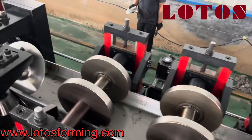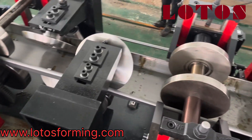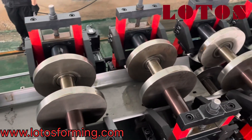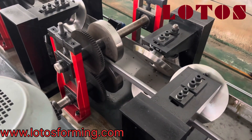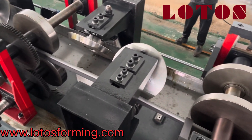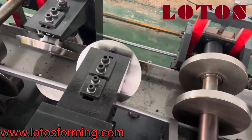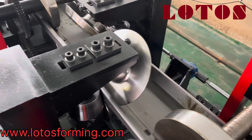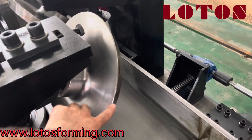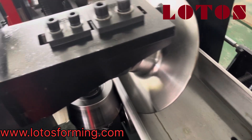Up to five millimeters, driven by gearbox. So later if you have a different profile sequence and you need to adjust the roller here, it's the same process. This roller is also going to make a sharp angle for you — you can put it in front by this screw or take it back.